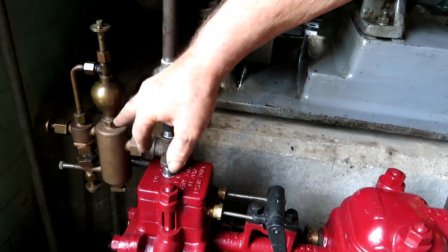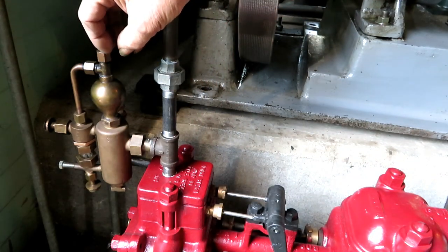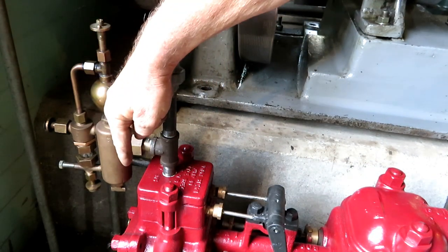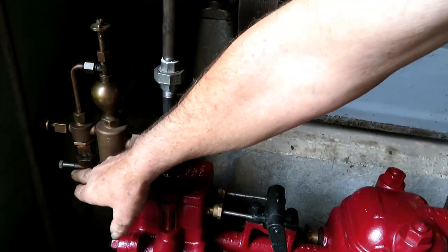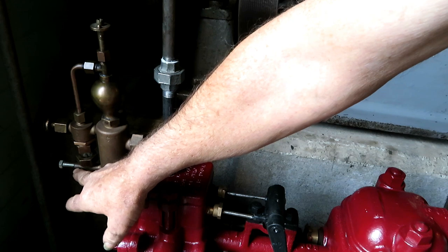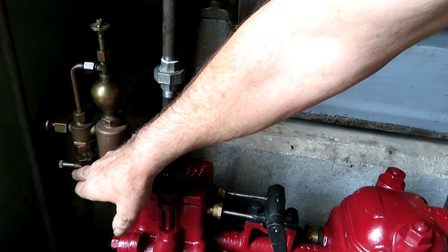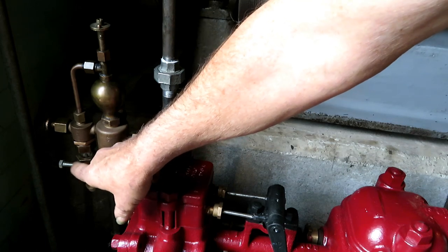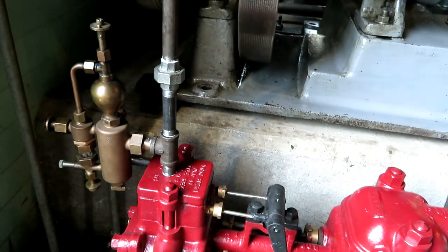The steam comes through here and ends up in this dome and condenses into water, goes to the bottom, makes the oil come up. Here's the sight glass. I'm missing one thing for it. There's a drain screw here that happens to be a 5/16 coarse thread, so I'm gonna make a little shutoff screw there for that.